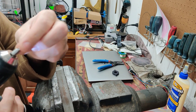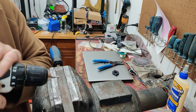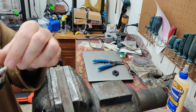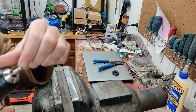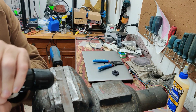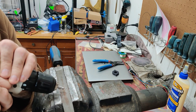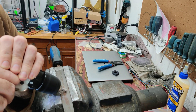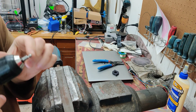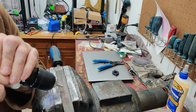I've already done this — the bevel is already here — I'm just doing this to show exactly what I do. I put the drill on high speed, then right here on the file, just run it back and forth until you get rid of the square edge. You want to end up with as little flat as possible on the tip. I'm going to try to make my angle slightly more than 45 degrees. If you can get to 60 degrees, that's probably ideal — just run it like this. This gives you a nice even bevel all the way across.